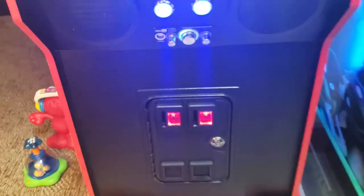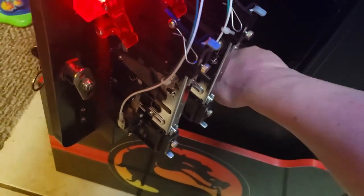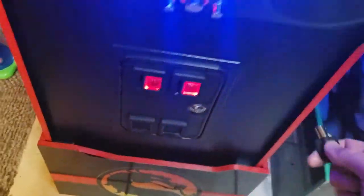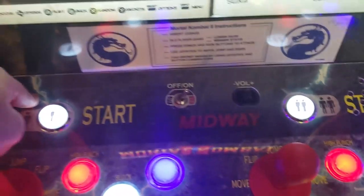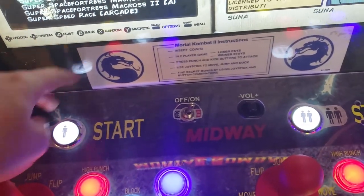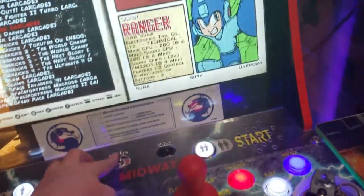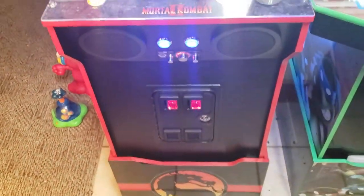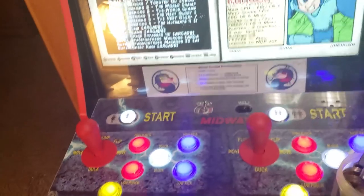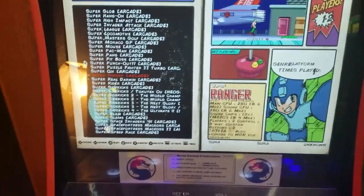The coin door actually works, and it's required in this one — there are all the quarters. I've got everything powered on this switch, I think it's a 4PST. The power supply is an actual arcade power supply with 12-volt and 5-volt rails. Everything is powered by that, including the amplifier and the marquee. The monitor is not on the power supply but it's on the same switch hooked up to the same AC power, and the coin door lights are on that same switch too.